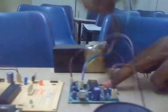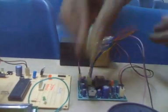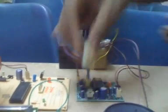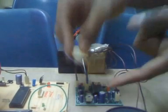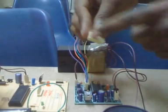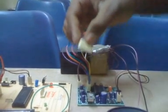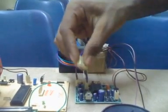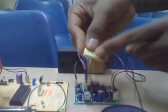I will remove the jumper from the REC pins and start checking what has been recorded. I connect each slot to ground to play it back — each slot has a stored voice. Slot one plays 'One,' slot two plays 'Two,' slot three plays 'Three,' and the fourth slot plays 'Four.' These are the voices I have just recorded.